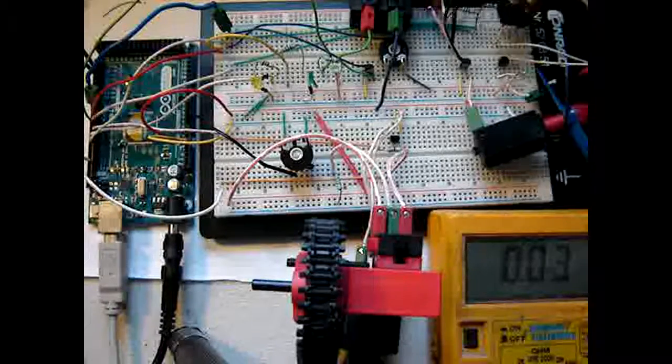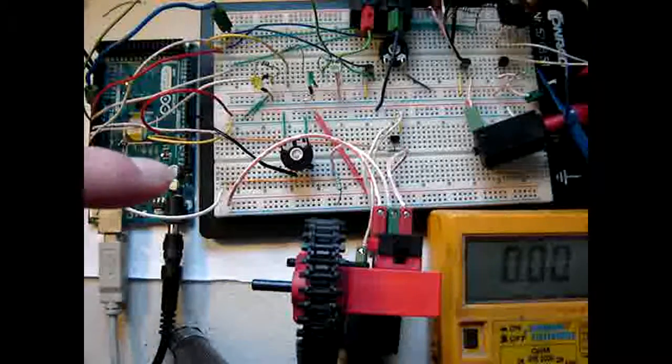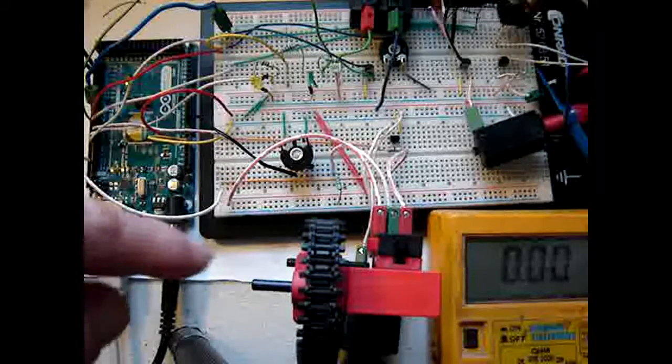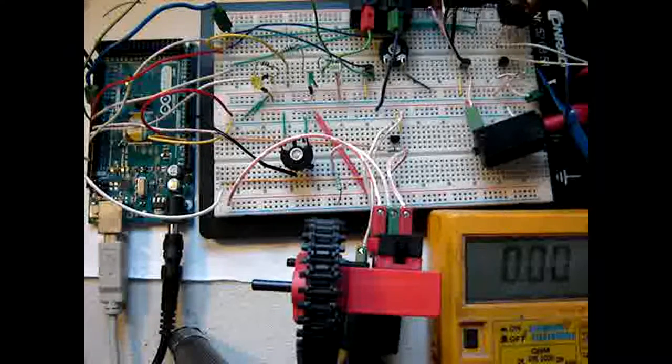Yeah, okay, this is a nice development. So the pulse width frequency is correct before the transistor. The transistor moves it way high, but only then the motor works. Interesting. I will have to find out how that further works, and I will do that in the next episode. So for now, thank you for watching, and certainly to be continued.